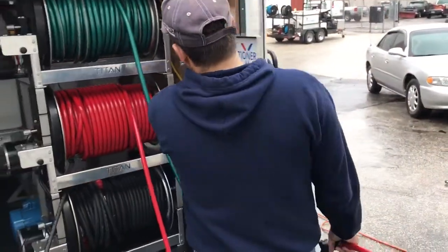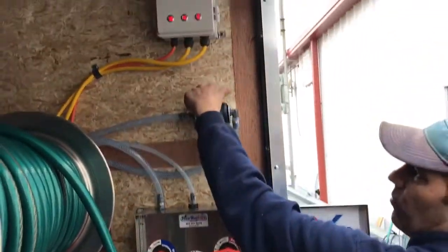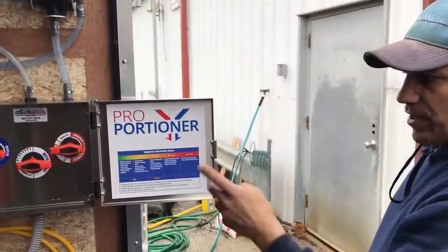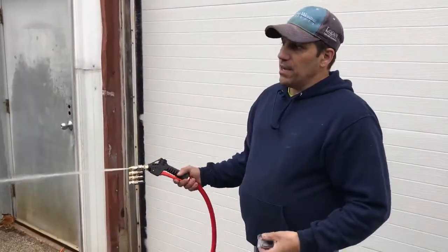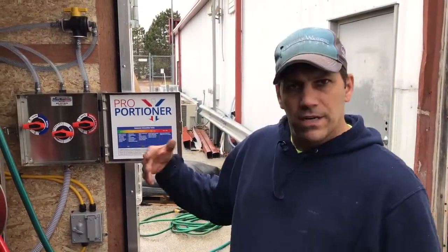At the end of the day, what we're going to want to do is turn the detergent off, turn our SH valve all the way up, and flush the proportioner out. So we're going to take the valve here and turn it back over to the water, leave our water open all the way, and just continue to flush with the booster pump. I'm going to turn the force feed off, and now I'm drawing through the proportioner, and we'll run that for a few minutes just to rinse it out, make sure everything's flushed really good and everything's clean. So that is the way to prime a booster pump — that was a brand new one, that's the first time we primed that, and you can see actually how easy that is.